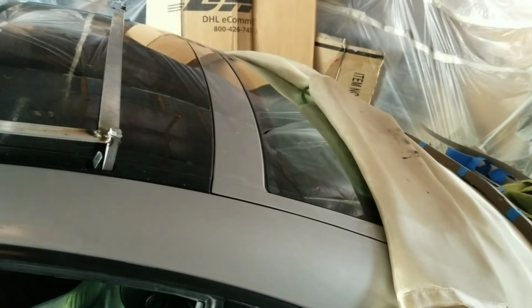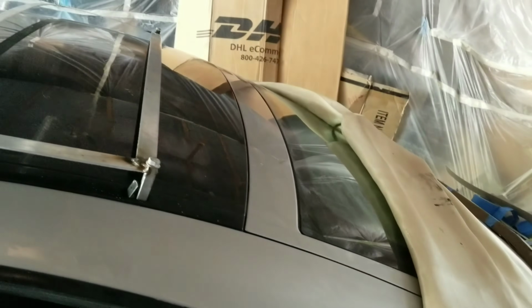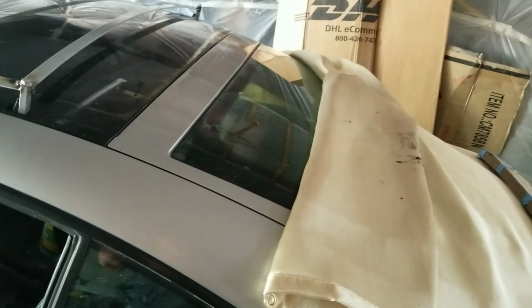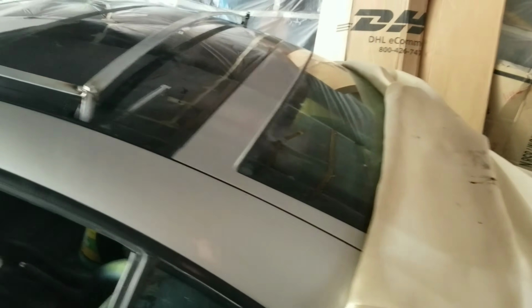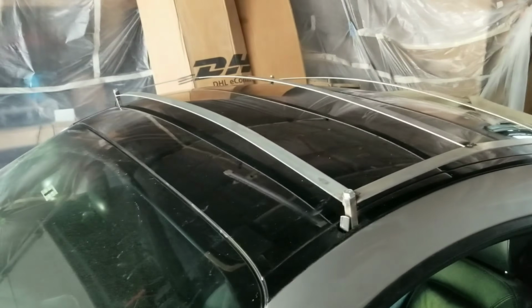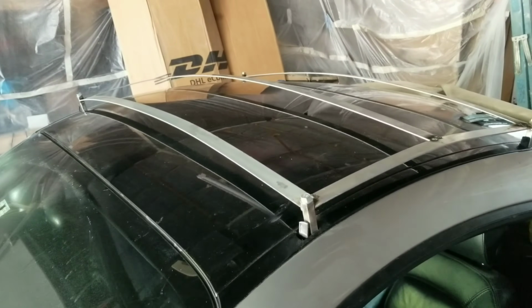You guys saw that I put the welding blanket only on the windscreen just because we only have one, and I think I'm more willing to sacrifice the paint, which we can either touch up or buff out, versus the glass, which will just actually melt. The polymer coating on top of the glass will actually melt, and there's not really anything saving that, whereas the paint I can actually fix.